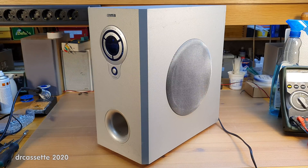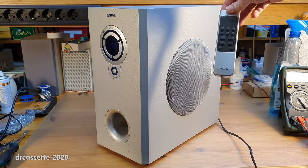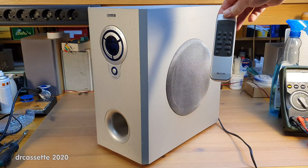Here is a Watson Digital Home Theater System, or more accurately, a subwoofer with built-in 5.1 surround sound amplifier. I have done teardown videos of such devices in the past, but this one is different because it was not designed to go along with a computer system. Instead, it was designed to go along with the TV in the living room because it is remote controllable. And that makes this interesting, because having a remote control means you can't just simply use potentiometers. You have to have some sort of signal processing, analog or digital, to make adjustments, such as the volume.